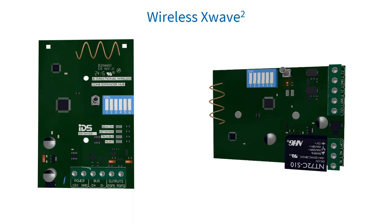When a detector is triggered, it will send a signal to the X-Wave 2 hub and keep sending until it gets acknowledgement from the hub, ensuring the alarm gets the signal. For the X-Wave 2 remote panic configuration, put DIP switch 6 up to disable the three-second any-button panic. So on your remote, if you hold your button down for three seconds, it will automatically send a panic signal. To disable that, put DIP switch 6 up.